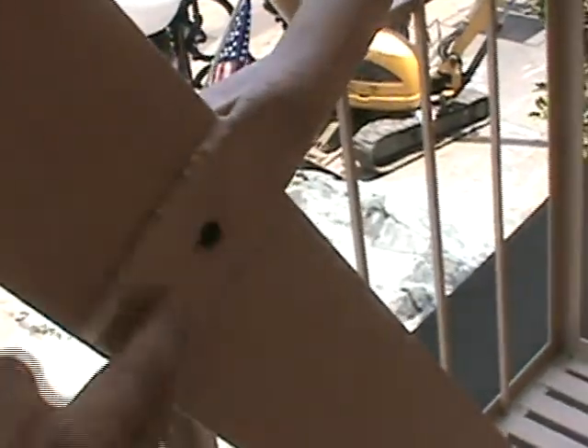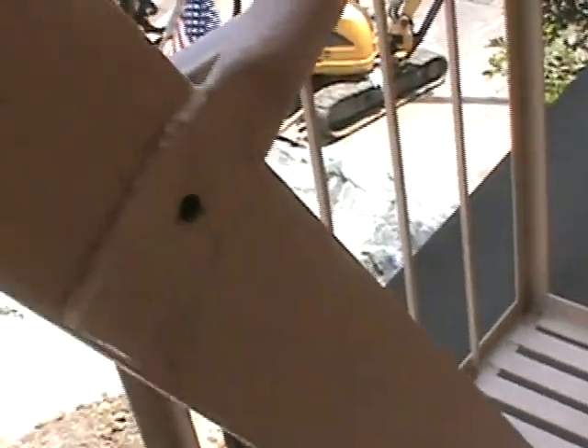Let's talk about this railing. We have this railing also welded, as you can see here. I need two bolts here, three bolts here — two to three bolts to double up this connection, because I can't guarantee this weld any longer.